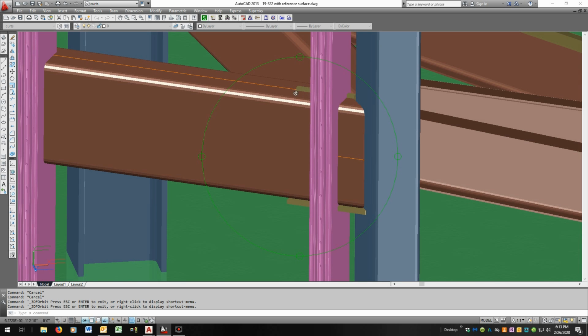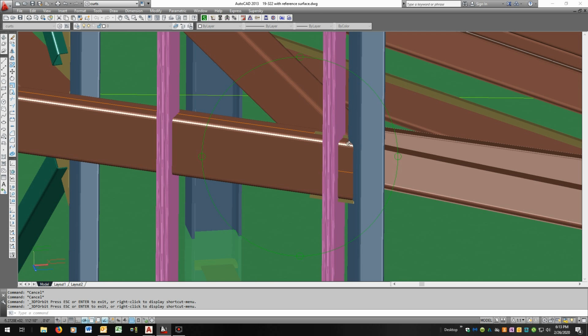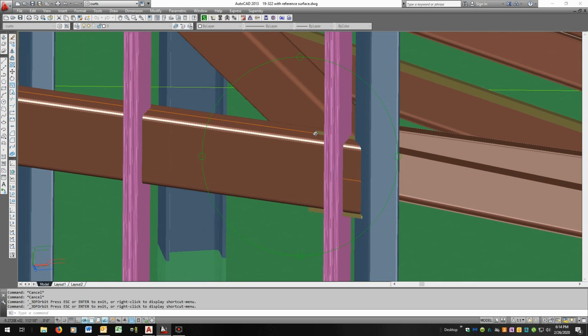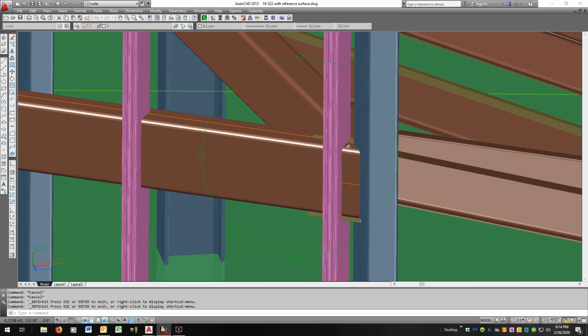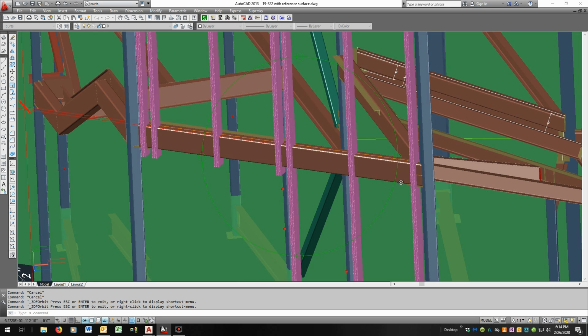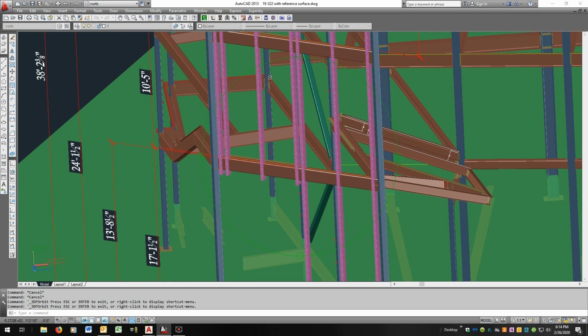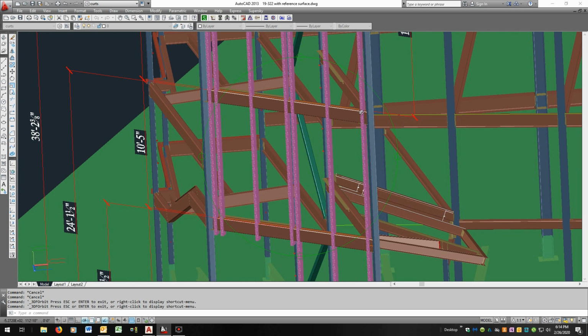Hopefully there's a way that this steel tube can be revised to be flush top and bottom. Maybe you can put an angle on the column here to rest the tube on before you do your welding, and maybe recess the knife plate below the top so you're doing a groove weld. As long as it's a flush surface, our bolts will miss the plate, but the frame does want to sit in that same space, so I can't adjust around it because of the detailing. So that needs to be revised on this tube, both ends. It's obstructing Super Sky's work, and the tube above has the same thing at both ends, here and here.